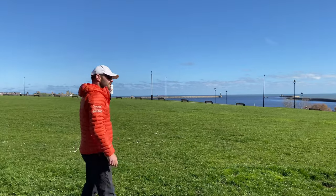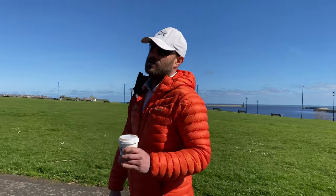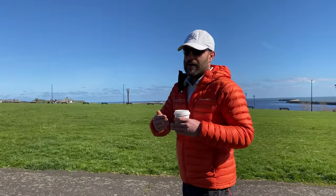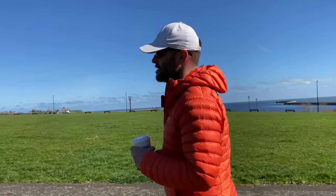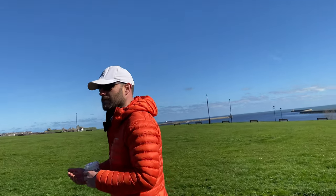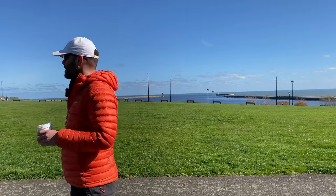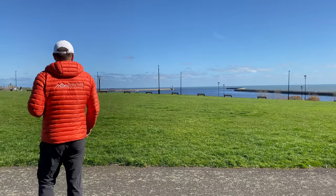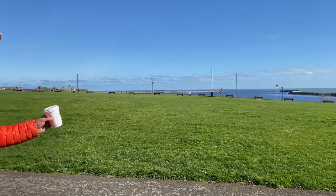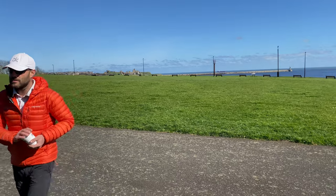That is why. That is the North Sea. We get really, really bad weather systems, and they just blast down these streets. The number after NHL is the strength of the lime. So NHL 5.0 is a strong lime, which is going to help combat the weather which comes from this sea. And yeah, that was the purpose. That is why we are using it, because this gets very naughty, especially in the winter months.